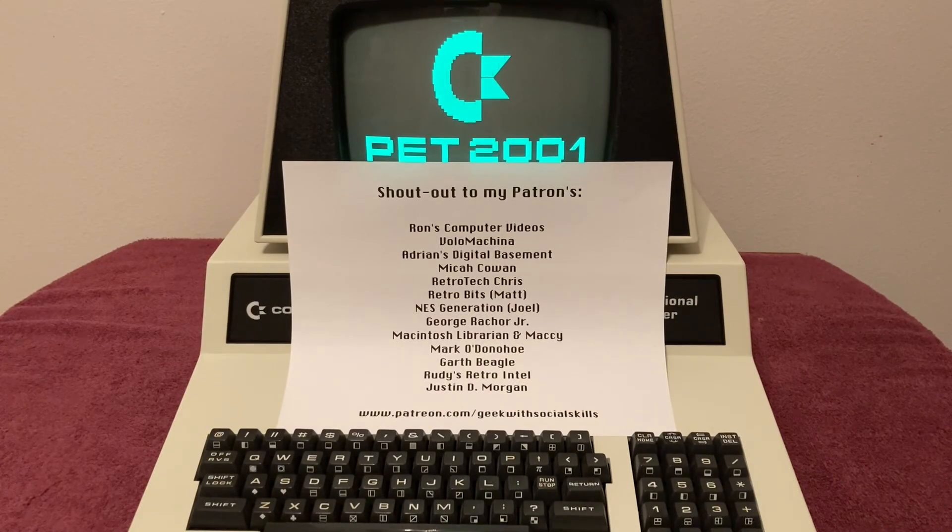Man, what a journey. Got this machine back in January 2020, started to revisit it two years later, some of the keys weren't working. Fixed the keyboard again — I did work on it back in 2020 — but this time I did conductive paint on every key cap and it works great. I want to thank Mr. Lurch and Adrian Black of Adrian's Digital Basement. They both pushed me over the edge, so to speak, to do the conductive paint and do it right the second time, two years later.